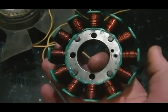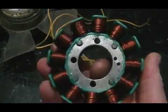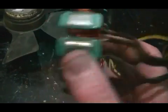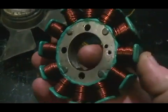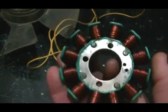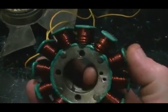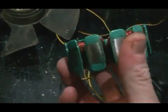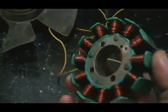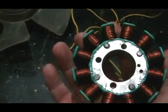This here I rescued out of an old motorcycle engine. It's a three-phase generator and it just so happens to have 12 poles on it, which is the same as what John's motors have, so that will come in really handy. The wires are way too thick so we'll have to peel all that off and rewind it. I'm going to rewind it a little differently because I want each magnet on the rotor alternating from north to south, so we'll have to wind one coil one way and the next one the other way. This is purely to stop the core becoming magnetized, which they do have a habit of doing and then the motor becomes weak. If we keep passing opposite poles across the coils that seems to keep the magnetic field in the core neutral — as in they don't obtain one.